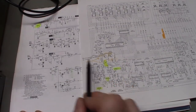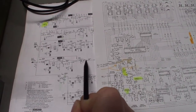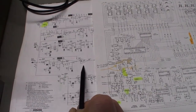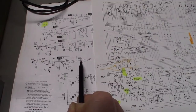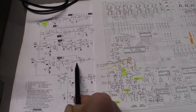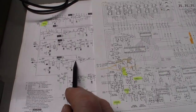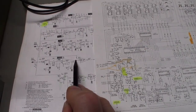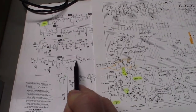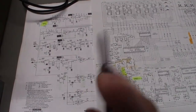There is one other possibility — if this two-input quad NAND gate is bad and its input is shorted internally to ground, that would sink our signal and eat it up. I would still expect to see a little bit of signal at pin 3 because it has to travel through some circuit traces on the board, but there's really nothing there. So I'm going to say that RF/IF amplifier IC is bad and pop it out.